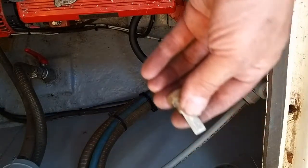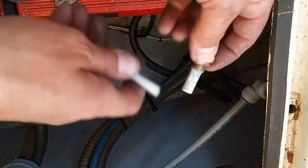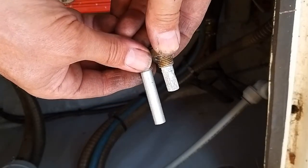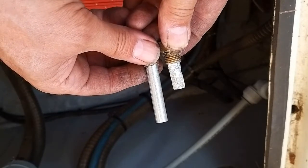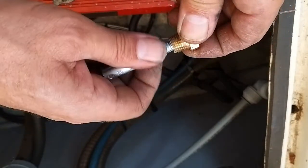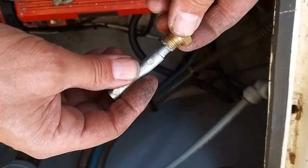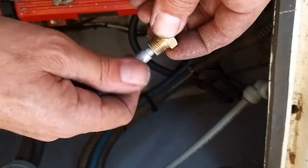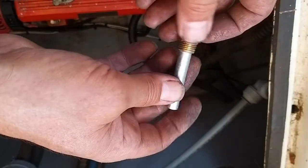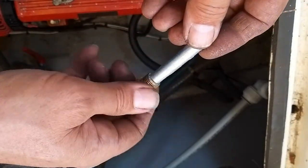Now there is a standard Beta anode, but here is an anode produced by a manufacturer in Canterbury in Kent — it is twice the length. They sell a kit where you buy this with a thread in it, so when they go you just thread a new one in. The last one I had broke off in there, but because of the size of it, it can't actually go anywhere — it was lying in the housing when I took it off.